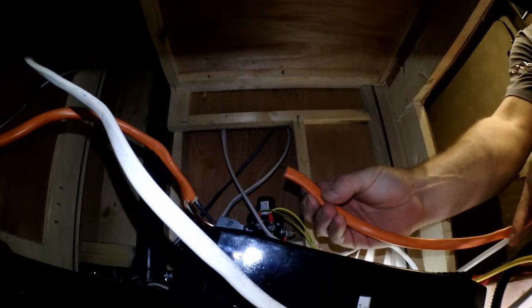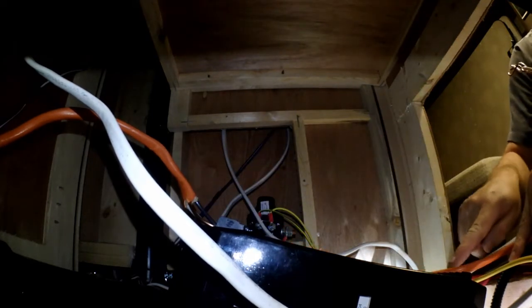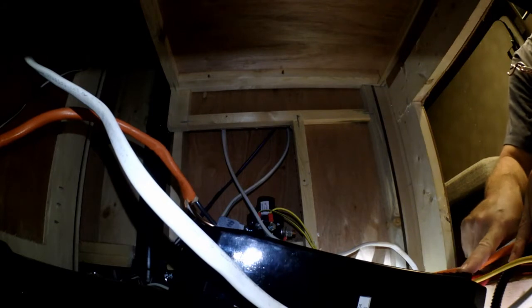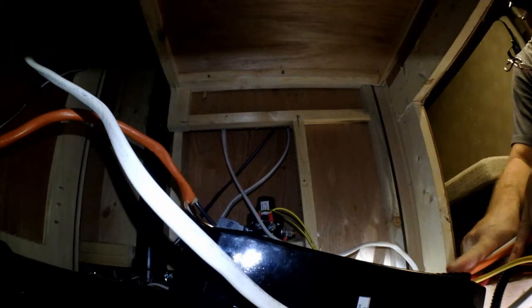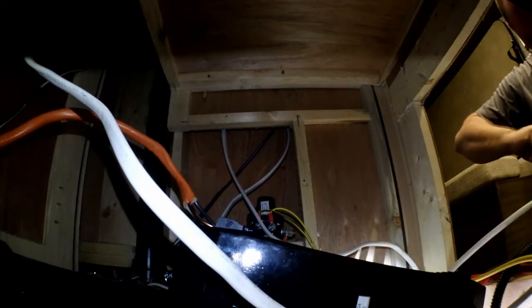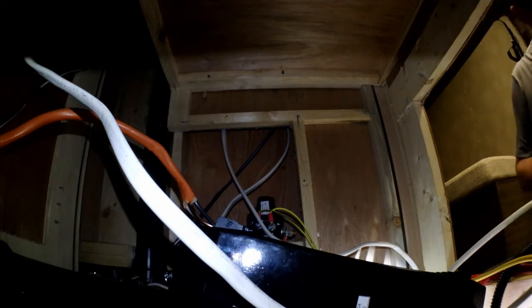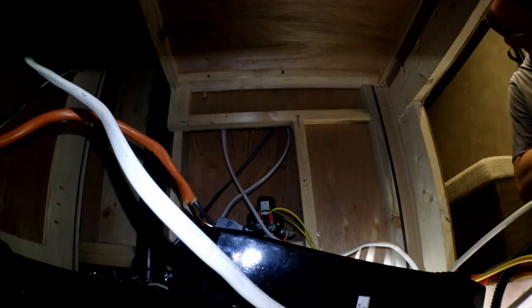Now I'm going to do the same thing with the output end I cut off. I'm going to strip it back, peel the insulation off just like I did the other side — strip the wires and put it all in on this side. This one is also black, white, green, in conjunction with the input side. Once that's done I'll put the little plastic covers on and mount it up on the panel. The key thing about this is it's going to protect us no matter what — whether we have a surge from the generator, a surge on the power line, or a power drop.